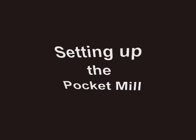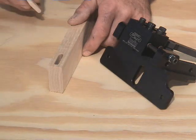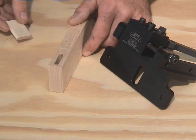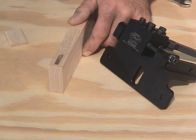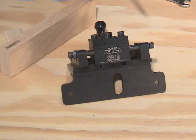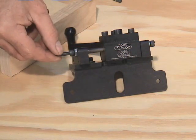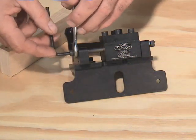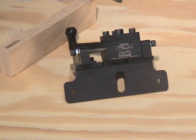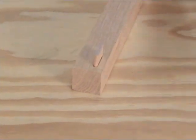Only a small amount of setup is required to get the pocket mill up and running. Begin the setup by making a test cut in a piece of scrap. If the loose tenon material won't fit into the mortise, you'll need to increase the length of stroke on the pocket mill. If it's too loose, decrease the stroke. The carriage stroke adjustment screws on either end of the mill control the length of the stroke. Turning the carriage stroke screw in will shorten the stroke, resulting in a shorter mortise. Backing it out will lengthen the stroke. Be sure to lock the screw in place using the nut and a 7/16 wrench. Adjust the carriage stroke screws until you have a perfect fit between the mortise and loose tenon material.